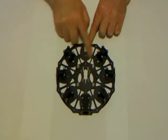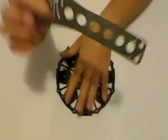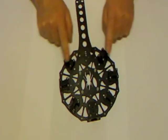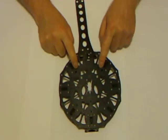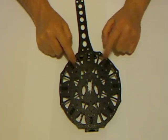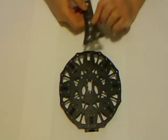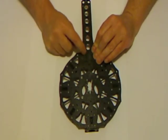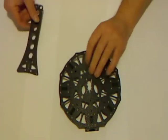Okay, now, as I said, I've left off the rear Delrin block, and there's a reason for that. With the Vampire and a few other kits, you get these extended tail plates that hang off the back, and you actually have to fit that as part of mounting blocks. On a Stealth Recon, you actually have to secure it to the equivalent of those two screws, the innermost of the rear blocks, go into those holes. You have to actually do that, fit them to that. On the Vampire and the larger airframes, they do actually mount using 2 of the pin screws and a screw into the block. So that's why I haven't put the block on yet.